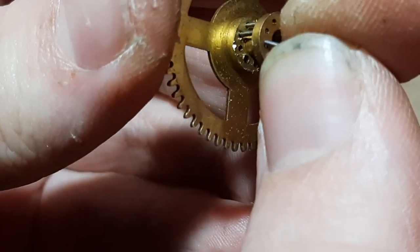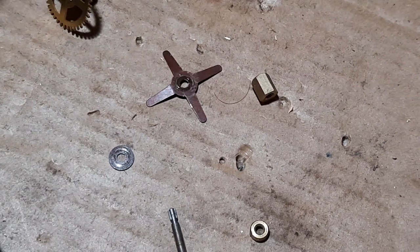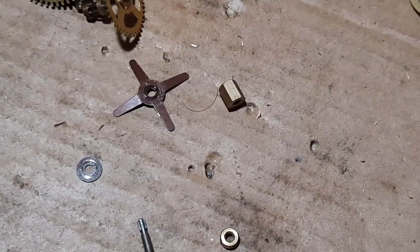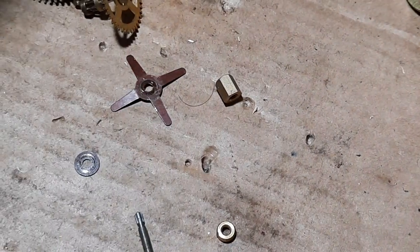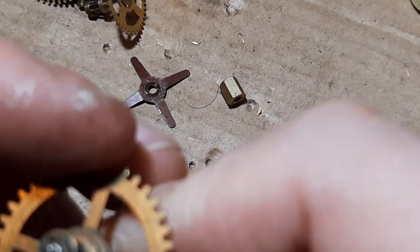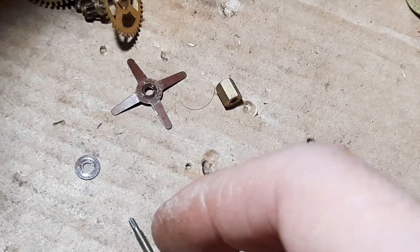I don't think we can just use any old wire - I think it has to be pretty hard. So what do I have that's hardened steel? Let's look in my parts box, or something which might have a pinion of the same size. This looks promising - however they're riveted in so I can't get them out. Well fancy that - the Chinese actually made a more serviceable movement than the rest. My respect for their clock industry has really gone up.